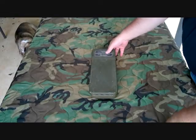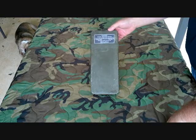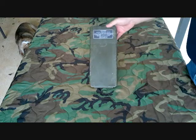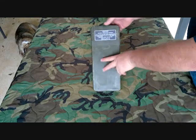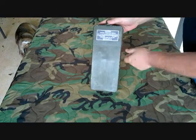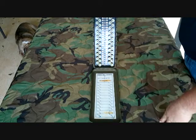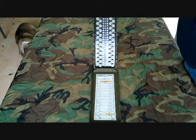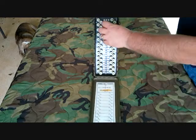This is a TM-125/GT terminal box. This is different from the terminal strip — it's an aluminum box with D-rings on it which allowed you to hang it from a tree, a post, or whatever, using nails, screws, field wire, or cord. It has a latch and it's fairly weather tight — not submersible, but it will keep rain out. When you open it up, you have a row of binding posts on each side — 12 binding posts for 12 pieces of field wire coming in one side and 12 going out the other.